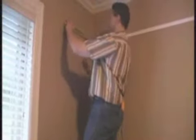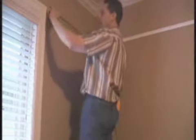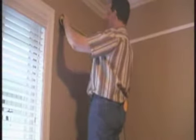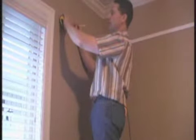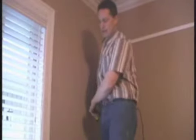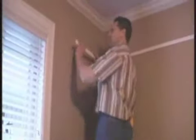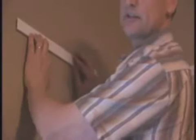So there's a few measurements that I need to take. First, from this end wall, I need to come out the 6 inches. I know that this corner unit is a 2-foot unit, meaning from this back wall to the end of the shelf will be 2 feet, and then there will be another 3/4 inches for the gable that will sit on the end of the shelf. So this mark, at the 2-foot mark, I cannot go past with my rail and cap. Otherwise I'll end up taking it off and readjusting it. And so if I'm on that mark, and I shouldn't go past the 6-inch mark, and I'm not, so it looks like it's perfect size.